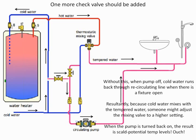That's what happens: they'll increase the recirc pump, but then they'll also increase the size of the recirc line as well, which is the other way they're doing it. It all works together, is the way I like to say it. Something that large should be engineered so that the piping and the pumping and everything is sized. You shouldn't just take something off the shelf and throw it in there, because at that point it really is a hydronic system. That's right.